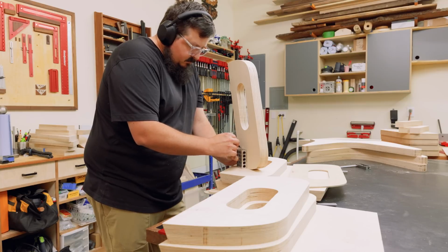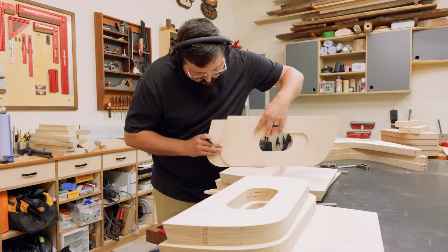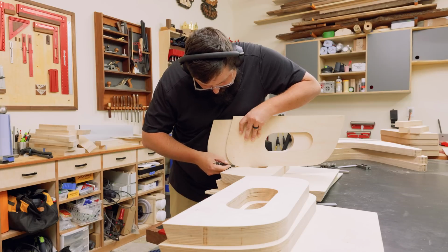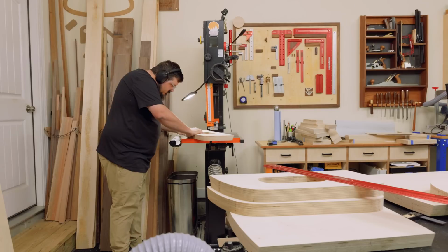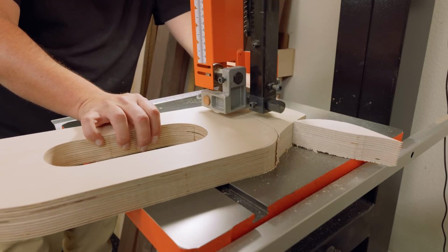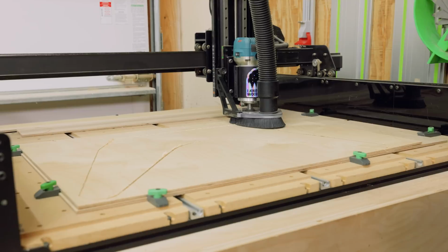the back side. This was made a little easier because I had already left my parts about a 1/4 inch long anyway. Again, easier to remove material than add it back. Love it when a tip comes full circle. The next step was a little trickier in that I had to move the back of my armrest template forward by 3 inches. And to do that, I just used my 1-2-3 block again.